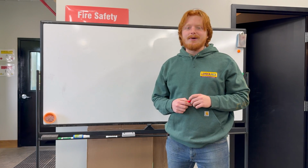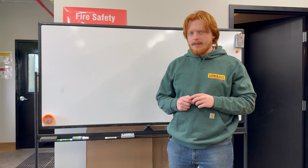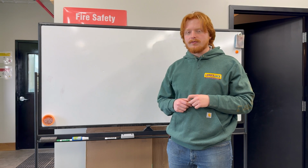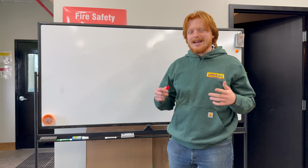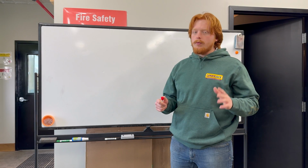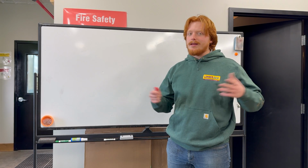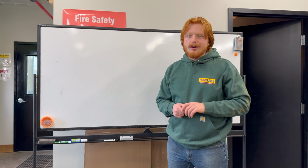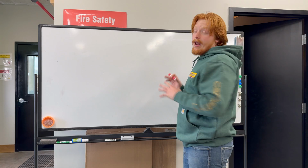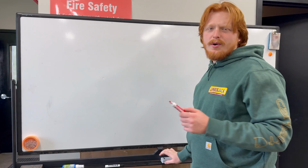So one thing we should talk about in this situation is how you coat and how you get out of the house. You remember how I mentioned that it takes a while for some of these floor finishes to dry? It can take anywhere from 1 hour for water base or 6 hours with oil. Well, you need to have an exit plan when you're coating the floor, or else you can get trapped in there and you're stuck there for a long time. So I wanted to draw it out for you so it was a little easier to really see what I'm talking about. Let's go ahead and draw this out here.